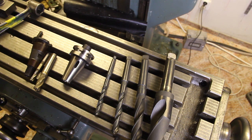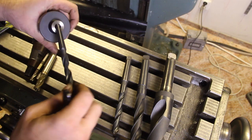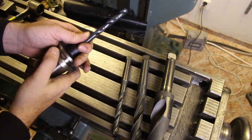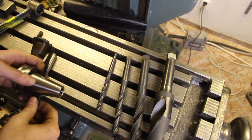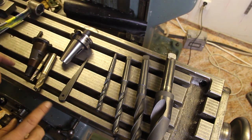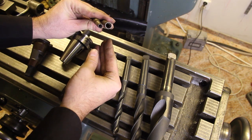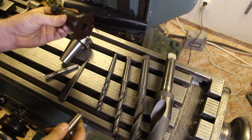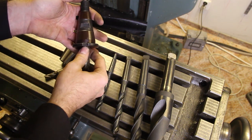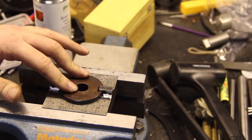There's also a little to be said about Morse tapers. I'm sure you've all used them for drilling. These are Morse tapers one, two, three, and four. You just put them into the Morse-tapered hole, tap them in, and when you want to get them out you use a wedge to knock them out. These Morse tapers are okay for drilling, but for milling they're not really good because the mill might walk out of the taper. However, there's a different kind — they don't have the tongue, just a hole with a thread, so you use a screw to hold it into the taper and keep it from walking out.